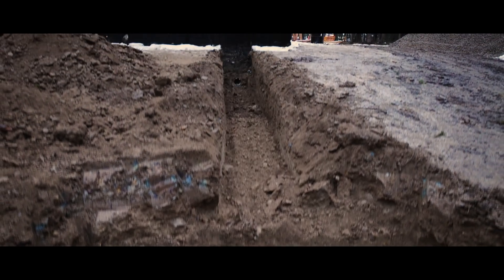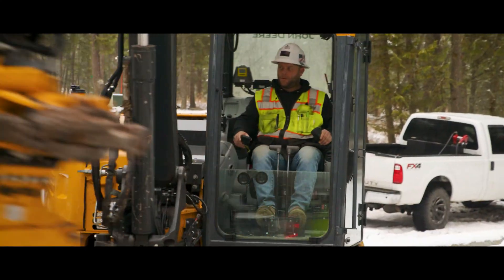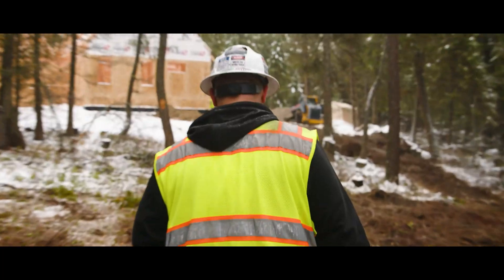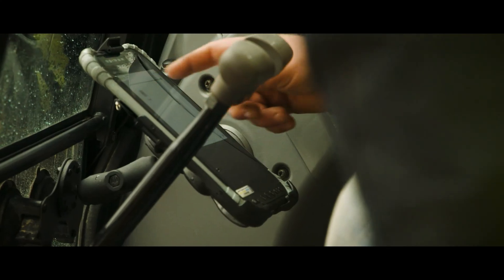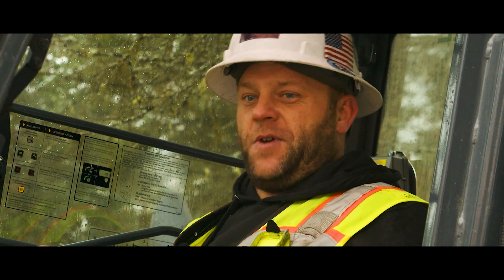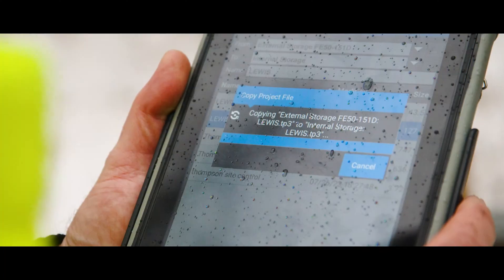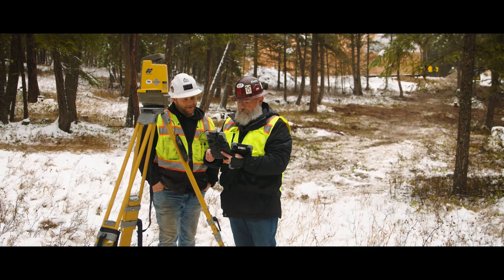We're doing the septic system for this house. We cleared quite a bit of trees for the site, did the house foundation, all the grading around it — try to make everything blend into the existing ground. I like to do something once, know that it's done right, and not have to come back. Most of the time they'll stake out a house site, then you clear the trees, the stakes get wiped out, then you've got to restake to dig it, restake again for the foundation — and things can just get off. With the total station, it has completely eliminated all that staking and errors in location.